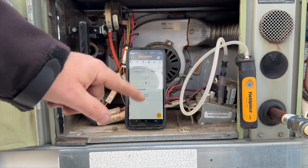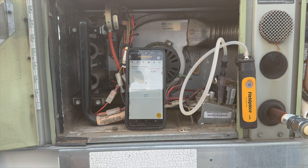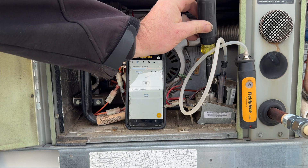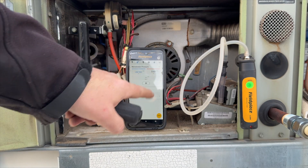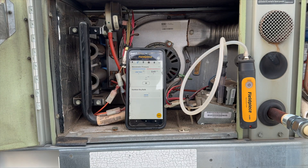She's been running for a little while. The gas pressure is definitely high — it's at 4.2. We don't want to go past three and a half, so I'm going to start cranking it down. She's been running for a little while and she's stabilized at about 3.41. I'll leave it there. The burners are making a weird noise, so I'm going to check the heat exchanger just to make sure it hasn't been burning really high.